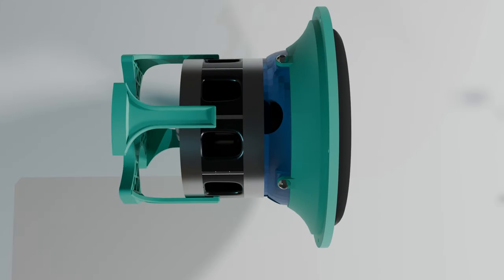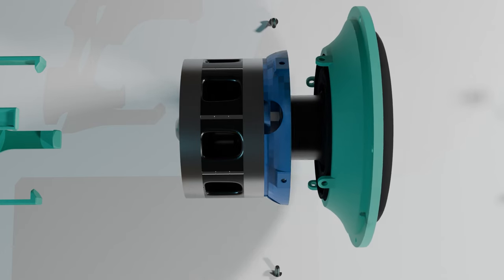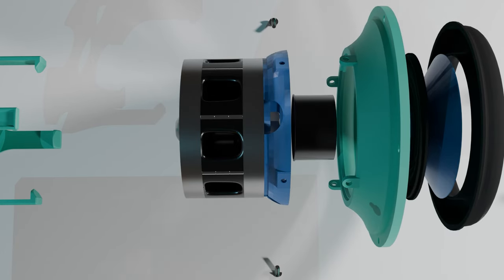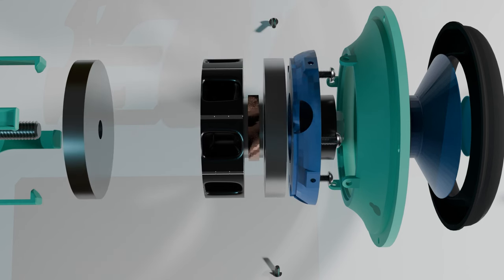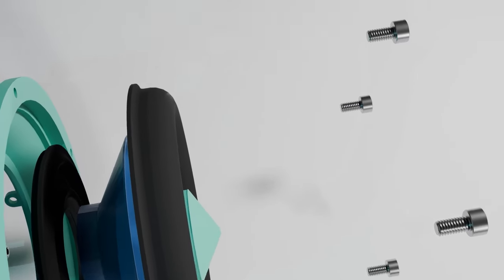Like all previous drivers, version 15 uses modular construction for rapid part changes that reflect the rapid nature of prototyping available from 3D printing. The chassis of the driver was constructed using PLA this time. The heat-centric parts, though, such as the former and magnet cooler, are ASA-based. The motor is an underhung design, and I'll touch on that again later in more detail.